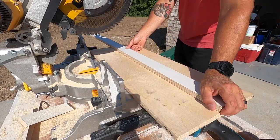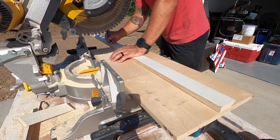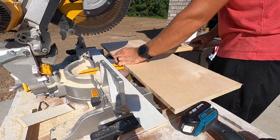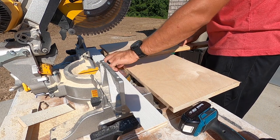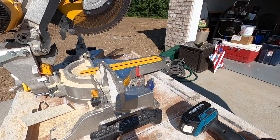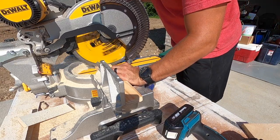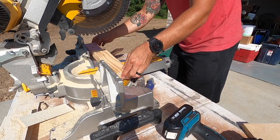cut my backer board as a full stretching. So this is the part that goes into the French cleat. And just kind of pieced this together. There was no plan to making this. And you'll see here in a minute, basically the initial plan produced kind of a weak mount up on the wall just because of how far away the edge of the shelf was. Now, even though it's just shoes up there, I didn't really want a shelf that potentially could fail, so you'll end up seeing me rebuild the box to be significantly stronger.